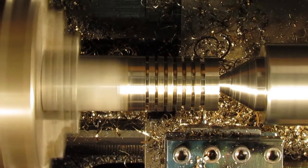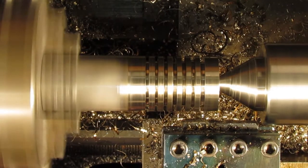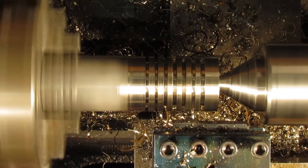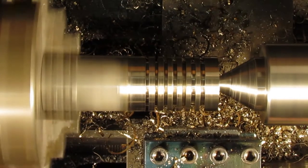The tool bit I ground for grooving measured 47 thou or approximately 1.2 millimeter. The grooves are 80 thou or 2 millimeter wide. Moving the tool bit back to the start, the bit was indexed to each measurement and then moved 31 thou or 0.8 millimeter to widen the groove to the desired 2 millimeter groove width.